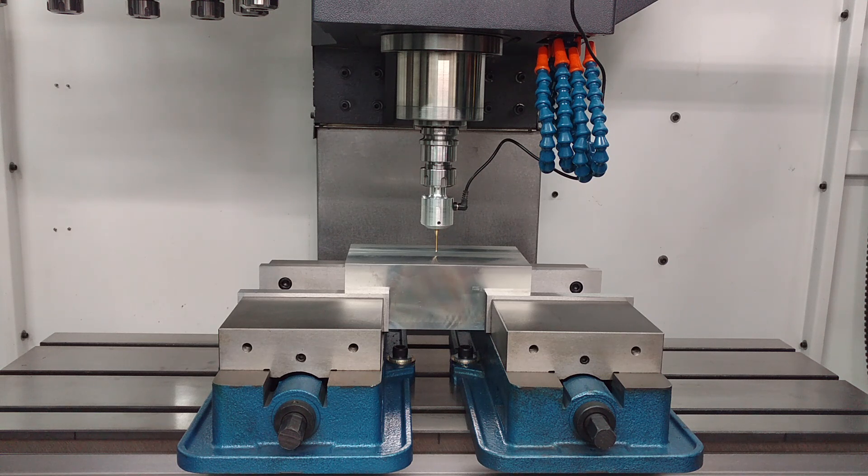I'm going to run this real quick and we're going to use it to set the work coordinate offsets for X and Y to zero. Then we're going to do a position-only probe function and see what the difference is.